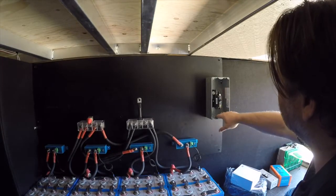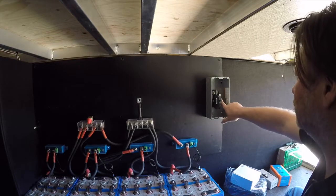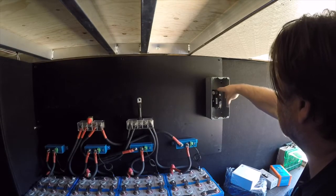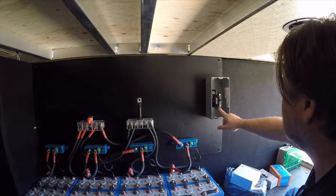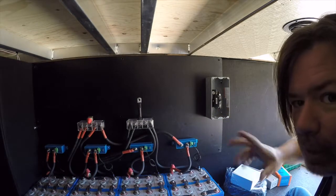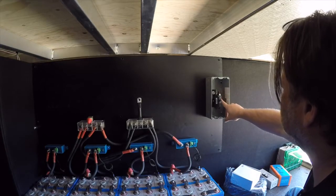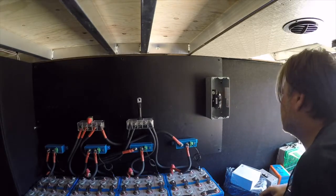The Victron will come up — see the bottom — there's a common bus bar over here. The hot going into the fuse will connect up here. The house wiring will come down, the hot will connect into this — both L1 and L2, both legs — so a red and a black wire. The white wire from the house will come in here, and all the grounds will be tied together and screwed down.